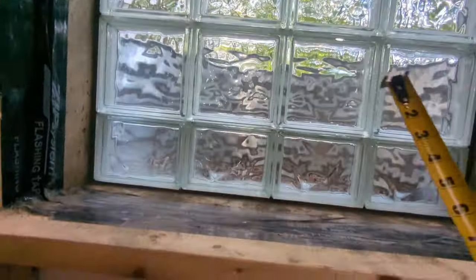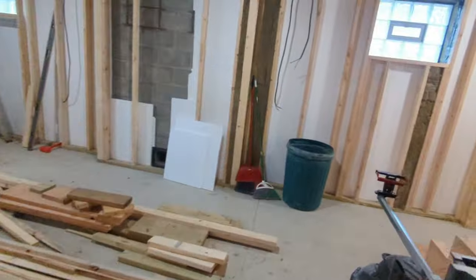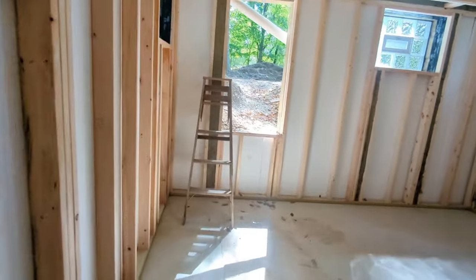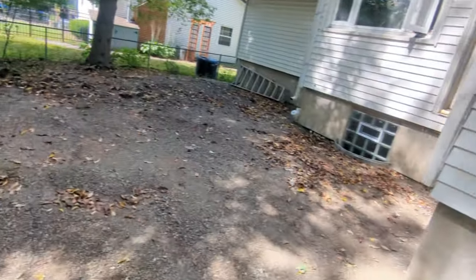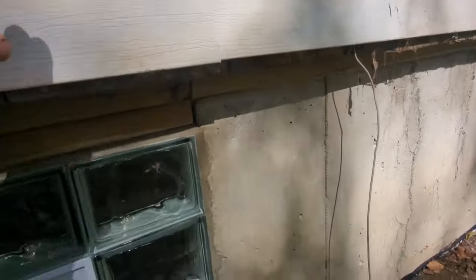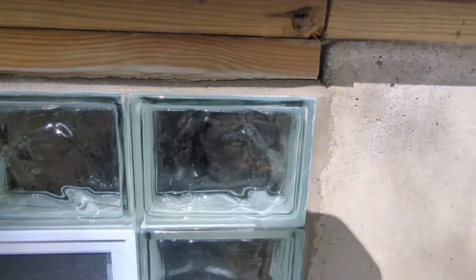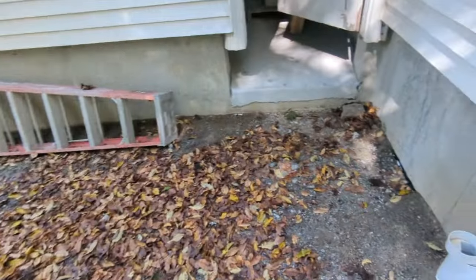So 2 inches of extra glass block. I guess that isn't awfully light. And see, that's only like 1/4 inch of mortar. So I guess it must have been based on what they know about not trying to hear people come back and say it doesn't quite fit. I gave him a rough opening and he didn't feel comfortable putting a full glass block across the top. Well, when you pull it in that far, because you only have a couple different sizes of block that you're able to assemble into the unit, then you end up with this situation where, see, the mason, he doesn't want to touch this up. This I added and on over into there. So this is something that we're going to want to make sure that we do a good tight job of caulking it up shut. Other than that, that's what we got going on there.